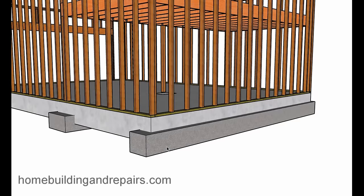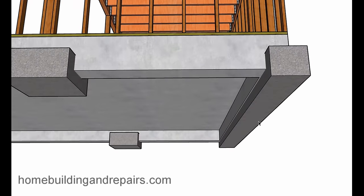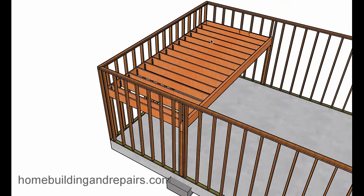One more thing: if you do this design, you might need to create an additional footing underneath the existing footing. I'm just throwing something out there that I've done in the past when an engineer actually required something like this. That is it for this video — hope it helps. If you are going to build a loft, feel free to use some of these ideas. Just remember, as I've said before, I am not a structural engineer and cannot provide official recommendations.